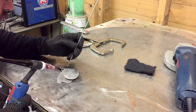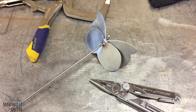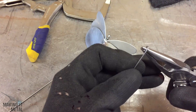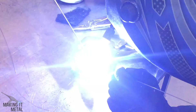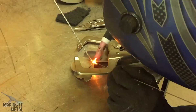I then added a support to the butterfly so it could be pushed into the ground. For this I used a 3mm rod that was around 500mm long. Next I made the antennae — for this I used a 1mm filler rod. I took my Leatherman tool and curled over the end of the wire and then trimmed this to length. To hold these in position I added a small amount of weld to the back of the butterfly, then held them up to it, warming the tack up just enough to fuse them into position.